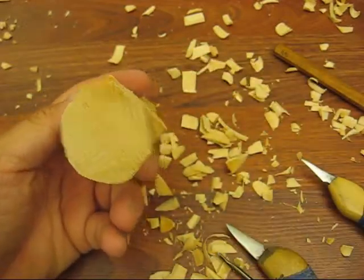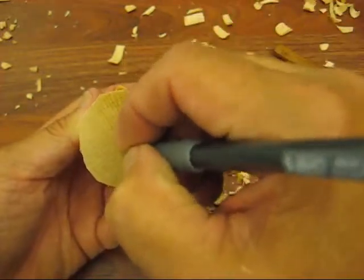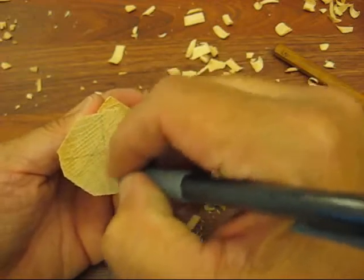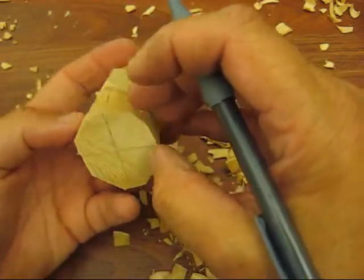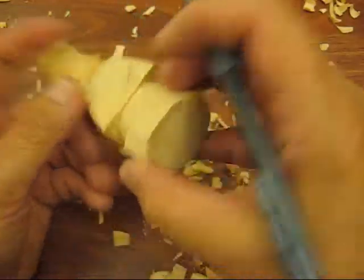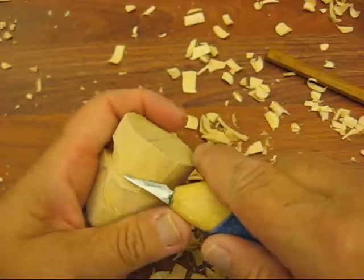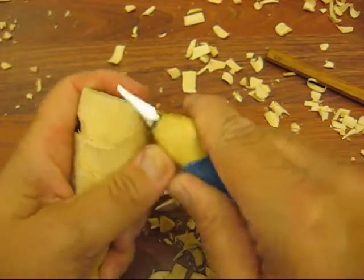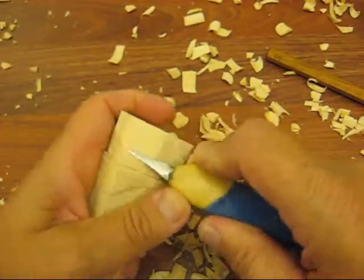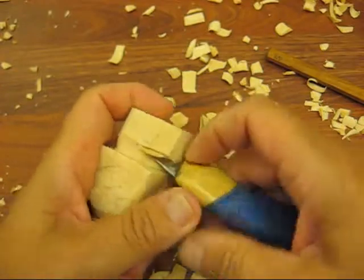If you really want to do this right — which I should have done ahead of time — from corner to corner, you want to put a line going across, and then from corner to corner do it across again. That will give you a real good indication if you're way off. Like this side is really cut up pretty much, which I can tell, and this side is not, so this has to come off a little bit more. Reference points are wonderful. Notice I went to a smaller blade because I need to get up underneath here. This is where the detail blades come in real handy.